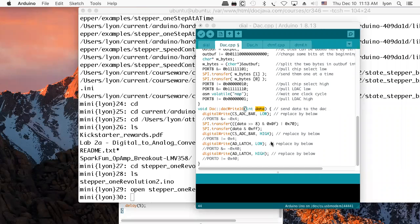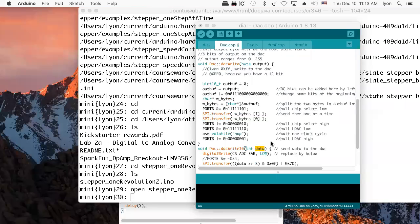So I mean, for maximizing the 12-bit DAC. Oh, I see. Yeah, I'm not sure if the transfer rates get faster as a result. This thing can already transfer at a SPI clock speed of 20 megahertz maximum, and there's just no way a 16 megahertz Arduino is going to get anywhere close to that. You're still transferring an upper and lower byte, if that's what you're asking. So it doesn't really save anything if the least significant 4 bits are 0. It doesn't save you anything, because I don't know, you're going to end up moving the same amount of data no matter what.